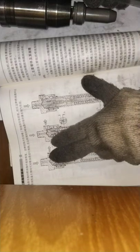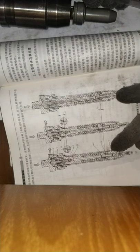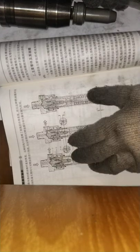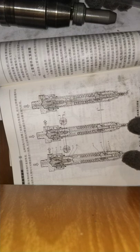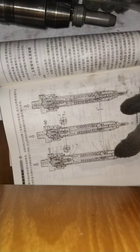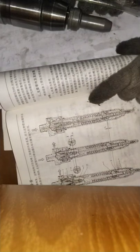If we don't have oil flow or the flow is too weak, the nozzle may be damaged and the spindle guide may become stuck. We must change the spindle guide or the nozzle tip when the injector is overheated, because the heavy fuel may generate carbon deposits on the close-fitting surfaces and damage the spindle. We will talk about that in another video.